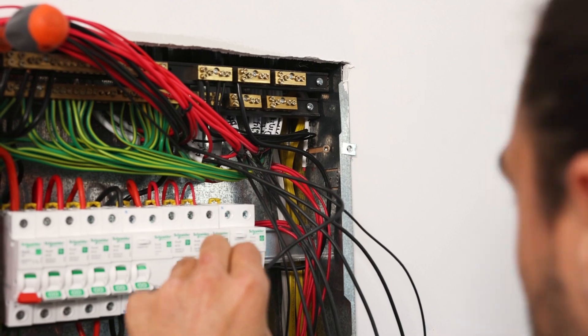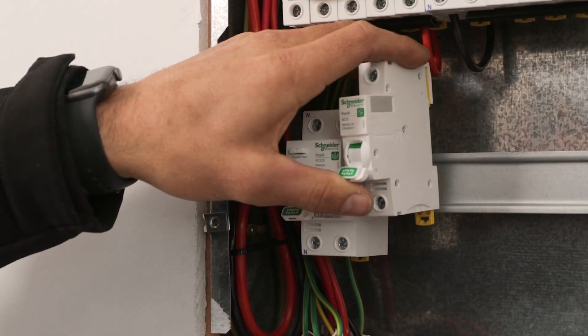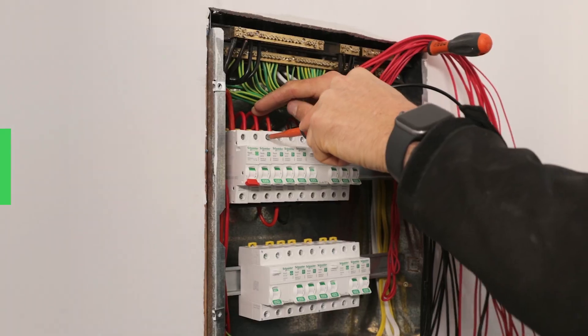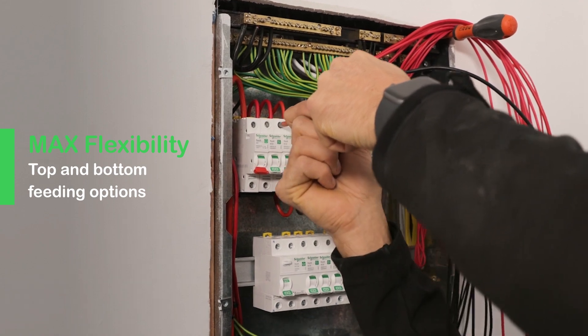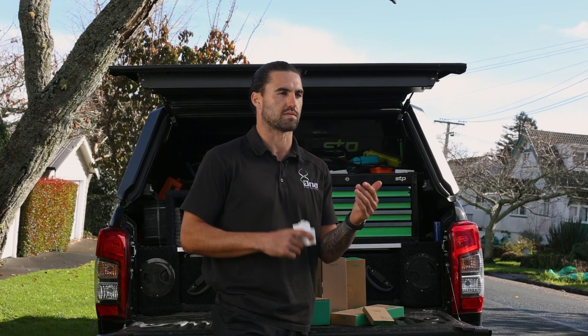Installing the RESI 9 range was really user-friendly because the top and bottom clips make them quite solid when you're terminating and cranking up the terminals — you don't get a lot of movement. Also, the fact that they're top and bottom feed makes it a lot easier depending on how you're setting up the switchboard.